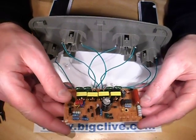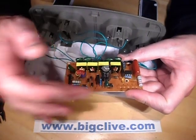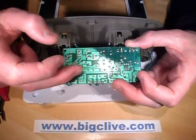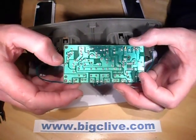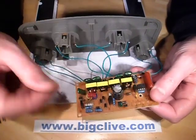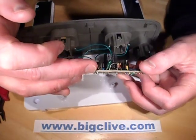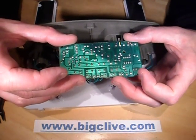The ballast looks like a typical compact fluorescent lamp ballast — it's got this little feedback transformer and two transistors. All these chokes are common, so the current is divided between all the lamps. And there's also a series capacitor there too, with half the series capacitors going to one side of the supply and half going to the other.